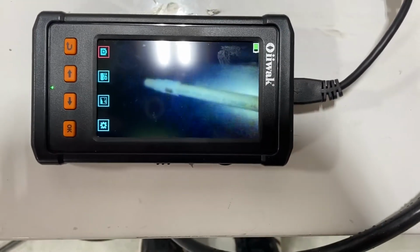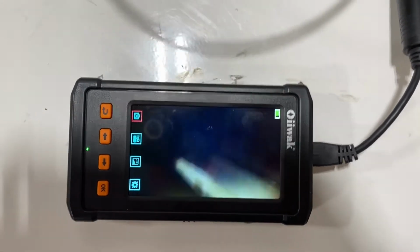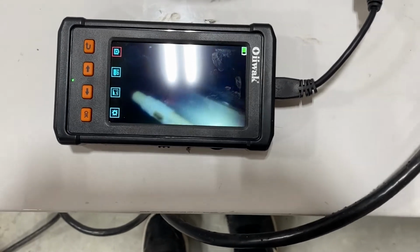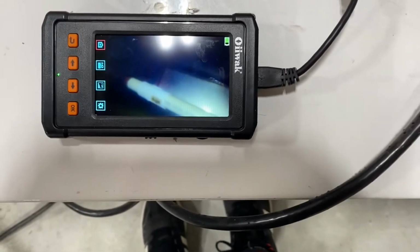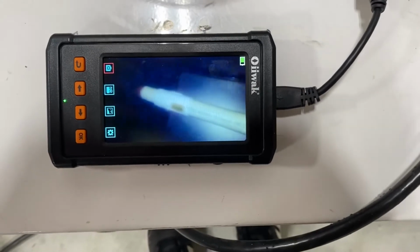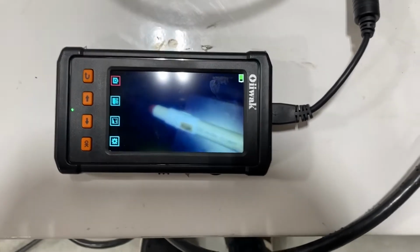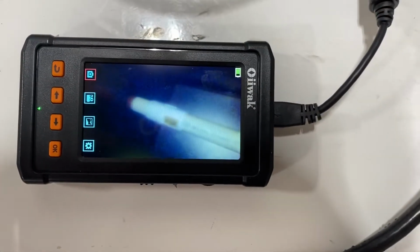Okay, so it looks like there is our siphon tube that hooks to the bottom of the pump. Now, I bet we just don't have enough fluid to reach that. Trying to move this just a little bit. I can't tell. Maybe it is in. Looking at this, it looks like it is in the fluid. Yeah, I think it is. Would you agree, John? Yeah, I can see a little bit of the end. It looks like the red. Yeah. So it's still not pumping. So that would indicate to me that we have a problem with the filter or with this hose.